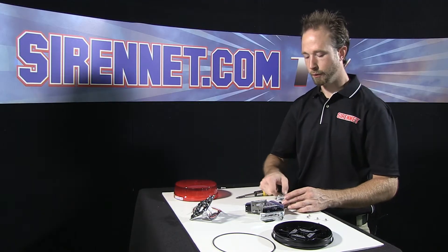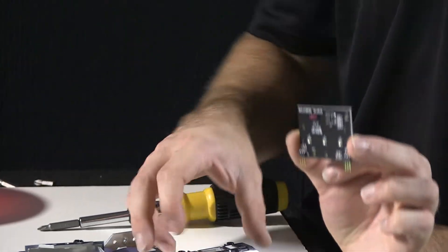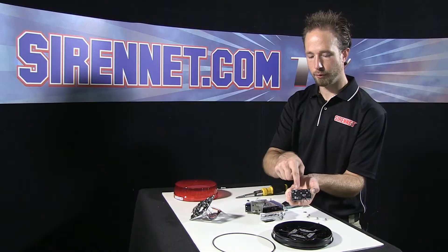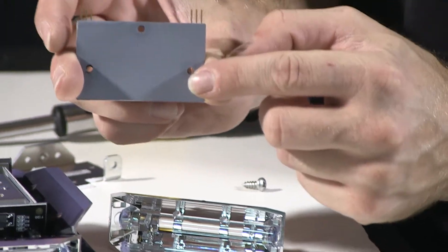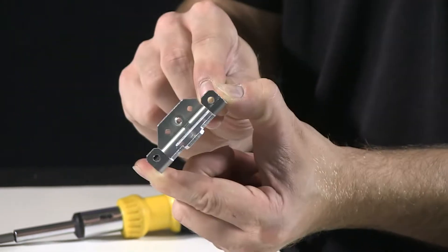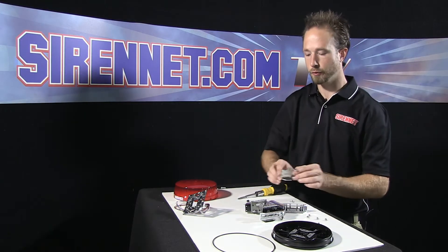I can free the aluminum backing mount portion and remove the actual diode board. So this is your reflector assembly here, free of any other components, and this is your diode board assembly here. A total of three diodes, again top connection mount points, rear the unit as well. Interesting to know is once it's affixed onto this aluminum mount here, this basically is acting as a heat sink for each of the diode boards inside of the L32. The heat then dissipates down the aluminum and to the base to spread out to cool the unit.